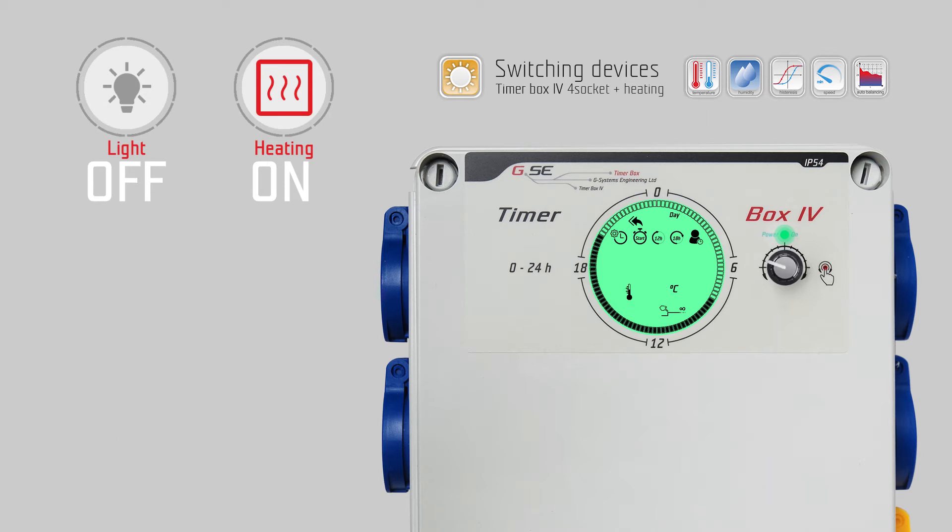Turn right to go to the manually on/off function and push the encoder to change the state. If the timer was off, activating this function will manually turn the timer on for the remainder of the cycle; at the next cycle the timer will be set back to automatic. If the timer was on, activating this function will manually turn the timer off for the remainder of the cycle. To check if the timer is set to manual, go to the main screen and check if the manually on/off icon is visible. To turn the timer back to automatic, enter the settings menu and set a cycle: 12 hours, 18 hours, or user cycle.